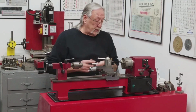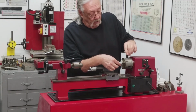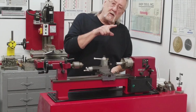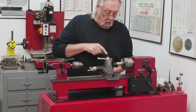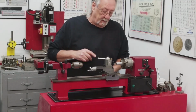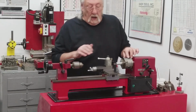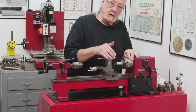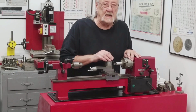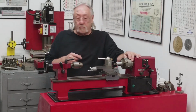My 3/4 inch piece of aluminum, 6061. I'm going to put it in here. Just chuck it up real quick. I already have a dead stop set up, or some people like to call it a carriage stop. Either way is right. I need to face it off, then drill about 1 inch deep. 5/16 threaded rods going through there.